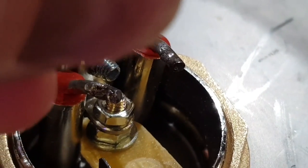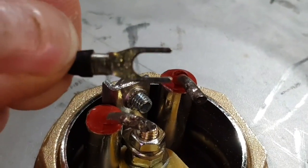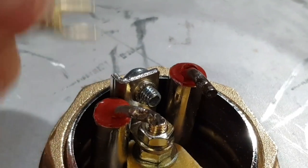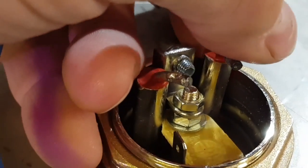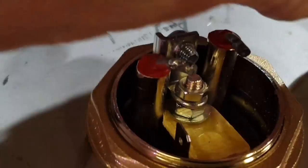What I have done - we've got this ready here - and the most important bit is this: it's crimped and soldered. That's the earth, so that goes onto this here. And then I'm going to solder these on as much as I can, and then going to put a strain relief and cover that over with a plastic cap.